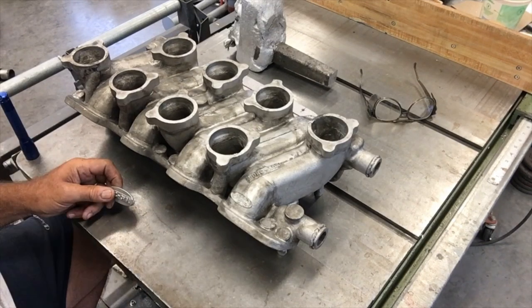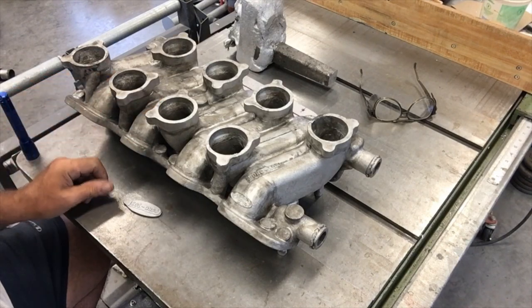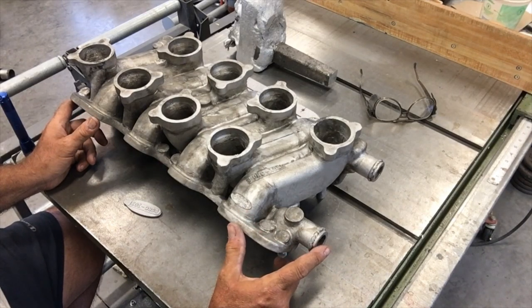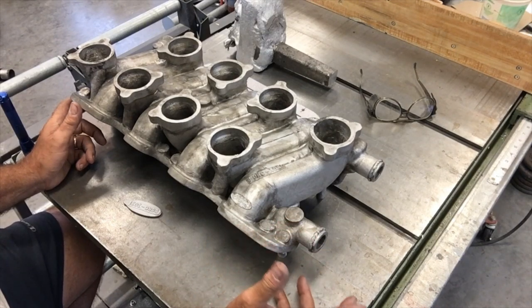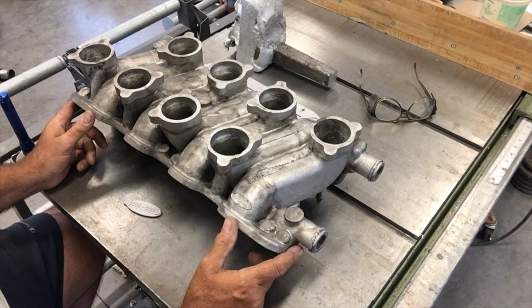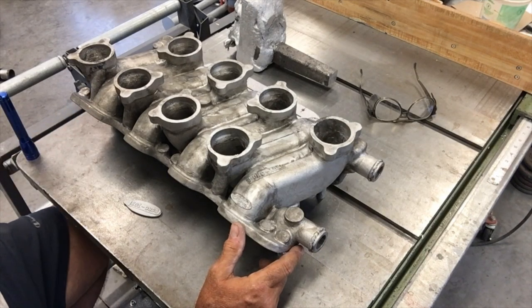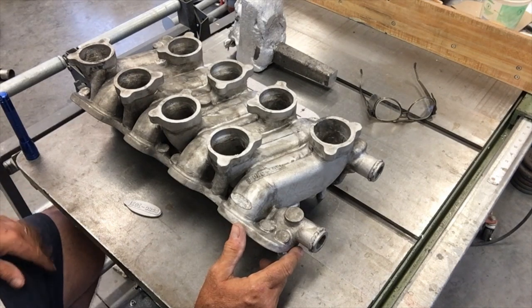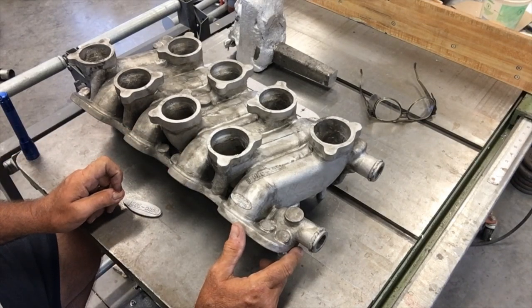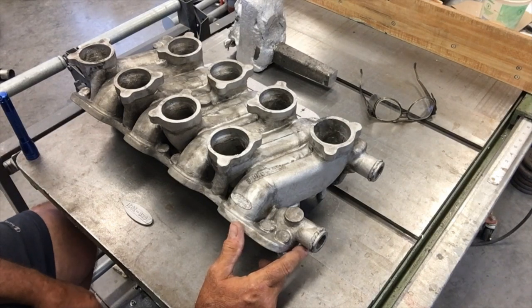One thing I wanted to mention too, there was a comment in one of my videos about carbon condensation trails, and one thing that's different than probably in commercial practice is that I quench these things in water, and that shock blows off a lot of the refractory. It just falls off naturally. But what it also does is it reactivates all the refractory because it's not fired, and it turns to this mud slurry. The refractory is full of carbon because the carbon diffuses out of the pattern through the refractory, but it gets caught up in the refractory. When it dissolves in water, it's basically like washing this whole thing in a carbon mud pie. So a lot of that you see is just the residual from the refractory coating being reactivated into slurry.